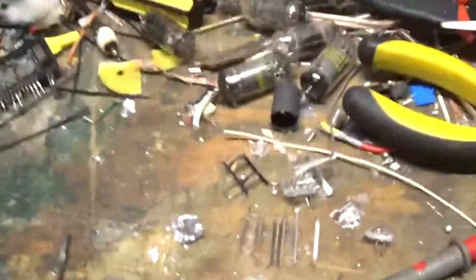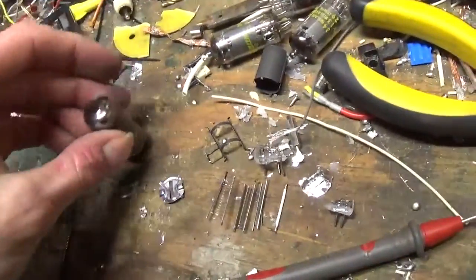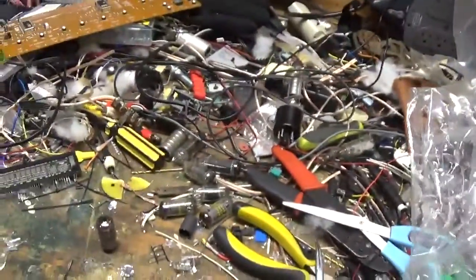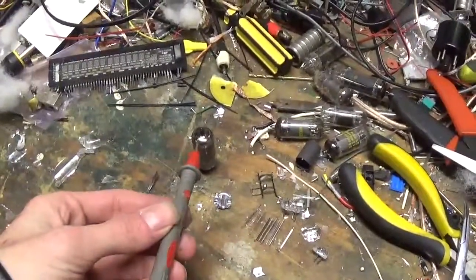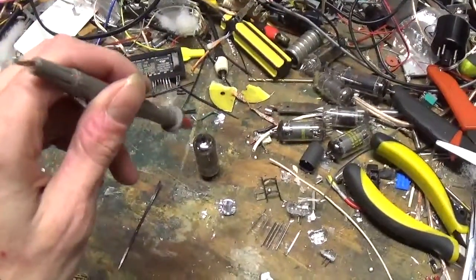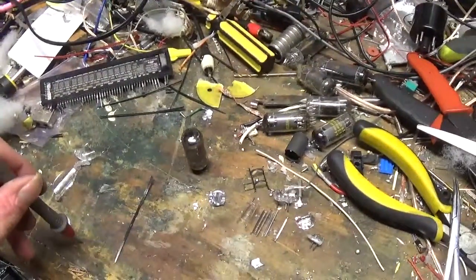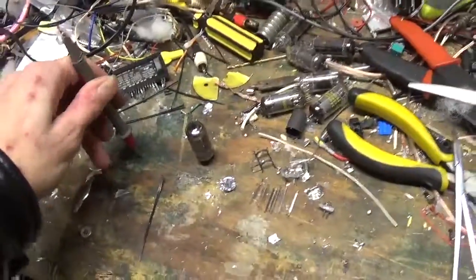That's how all that works. And of course the bottom would plug into the tube socket of whatever machine. And from there, it'll function. That's if the tube's good. Now don't get me wrong. Every single time you see these go fog white, that means the tube's no good. But just because that hasn't gone fog white does not mean that the tube isn't still good. It could still be bad.